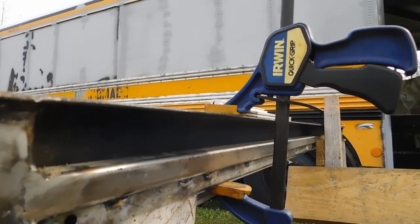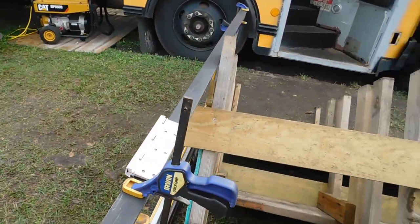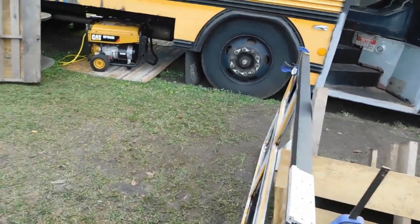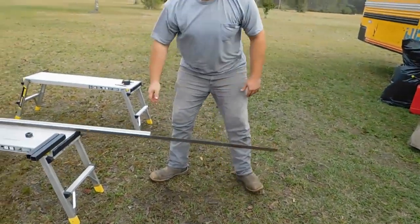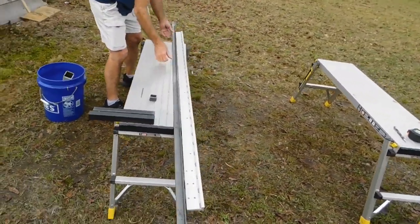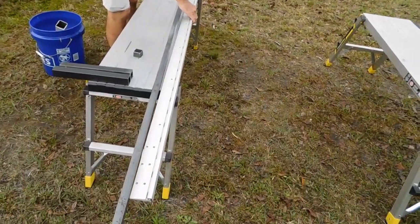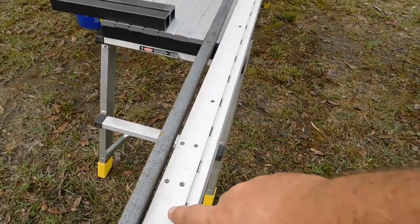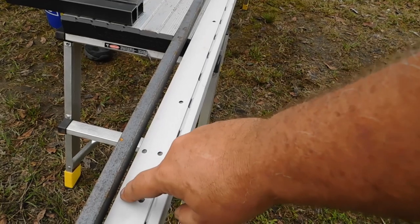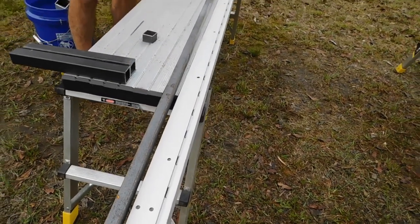So our cure for that is going to violate my warranty, but this door doesn't weigh 400 pounds, which is what this hinge is rated to hold. But what we're going to do is, as you can see, my cohorts in crime over here, we are going to take this actual long full hinge and scribe going right down the middle here, not between these ones, we're going to use the outside one, all the way down that way, and we're going to drill new holes.